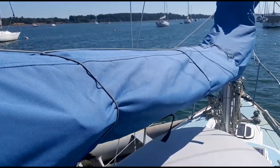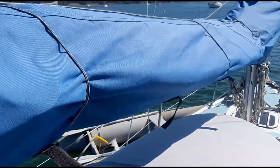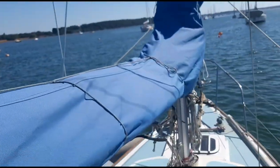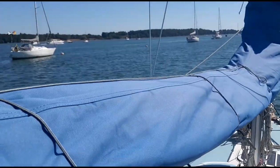Just a little tip: if you've got a pack sail like this, these can release and find themselves free and you end up with your mainsail pack coming off. So I tend to just get a small bit of paracord and secure it along the top, wrap it once round and then bring it back on itself. It just keeps it a little bit more secure and basically saves the pack itself from getting ripped off and getting punctured or ending up in the water. These velcro straps will work themselves free in a stronger wind, so this just keeps things together.